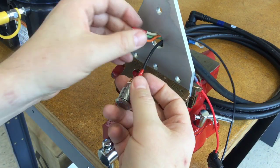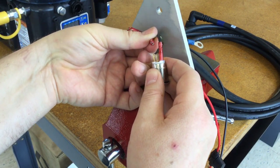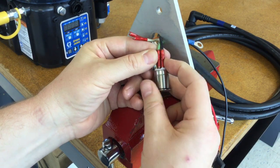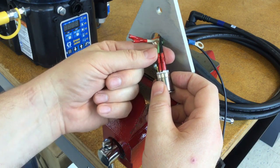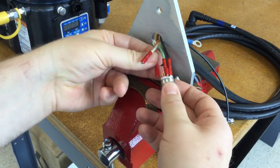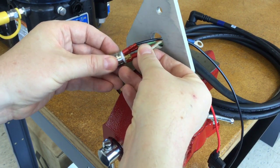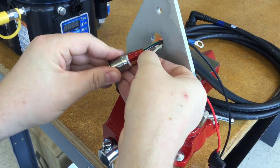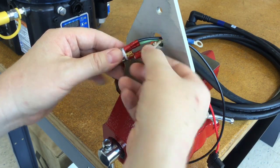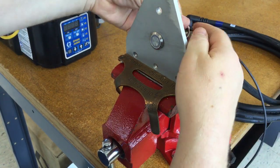Black goes to three, and for the Electric Grease Jockey, green goes next to it. One tip with the spade connectors: there's a flat side and a round side. Because the terminals are so close together, put the flat sides facing each other so you have room and don't distort the pins. Then orange goes on its terminal, and white tucks through and goes on its terminal as well. Once all wires are connected, push back through the hole and tighten up the hex nut.